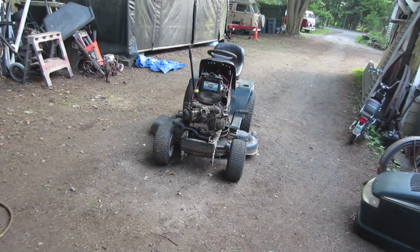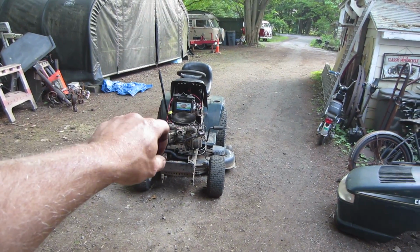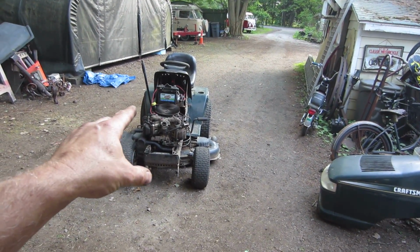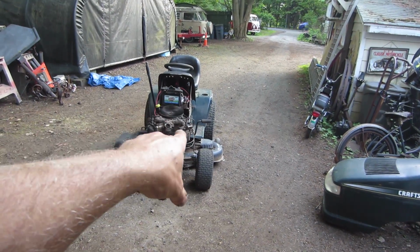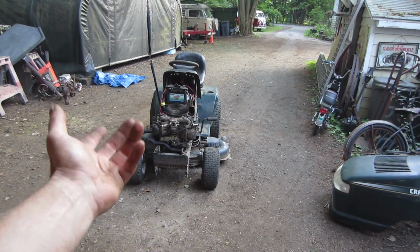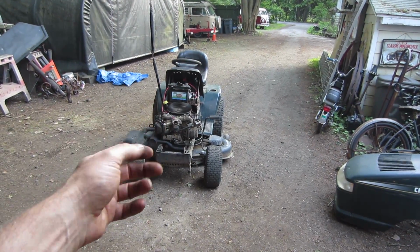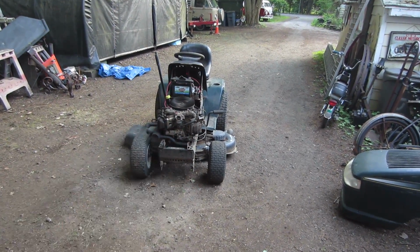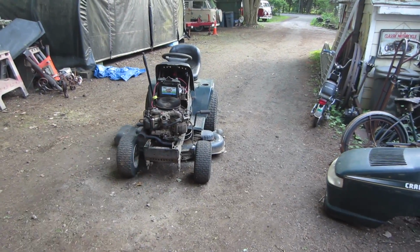The valves are clucking away a little bit. I had to turn the idle way down and the air-fuel mix out. It wouldn't idle. And probably what was happening was it was running on one cylinder, so to compensate for the fact that it was only running on one side, they had to turn the idle way up so it would idle. So I turned that down, got that tweaked in, seems pretty good. But you hear the valves clapping away on that side.